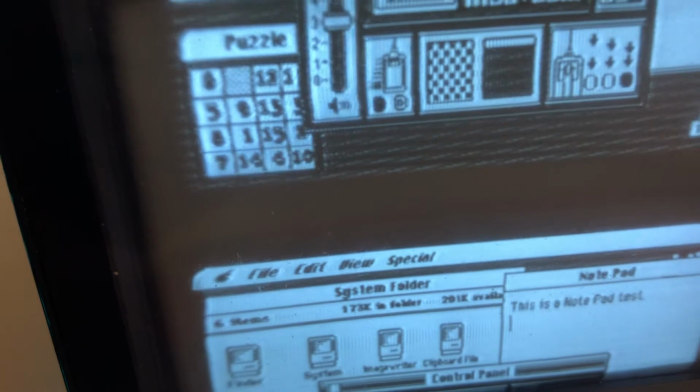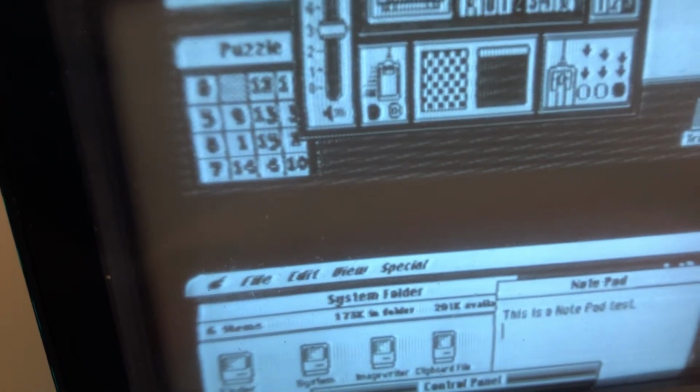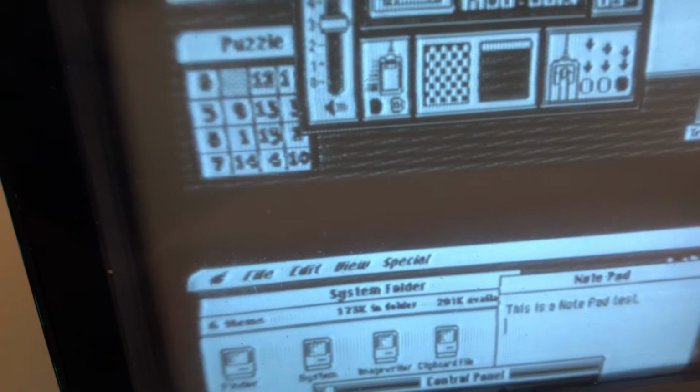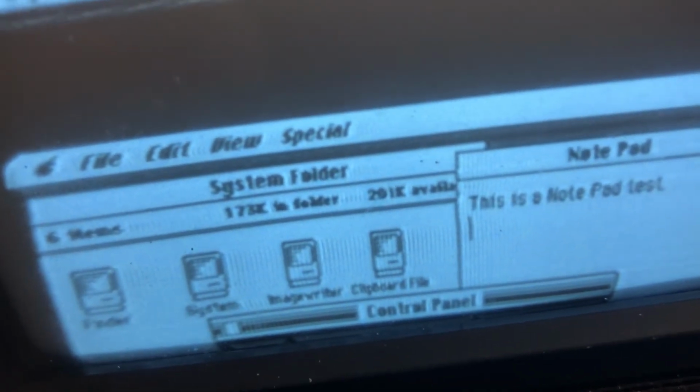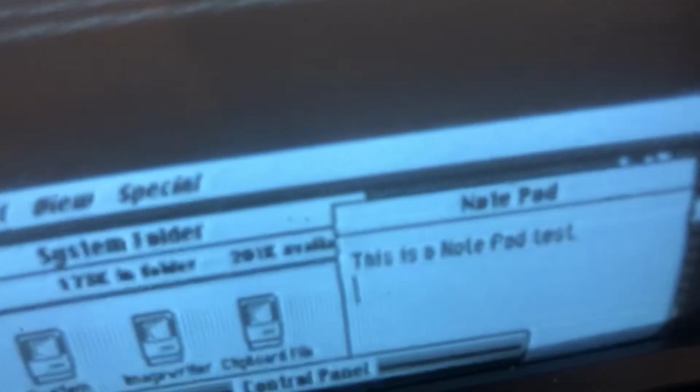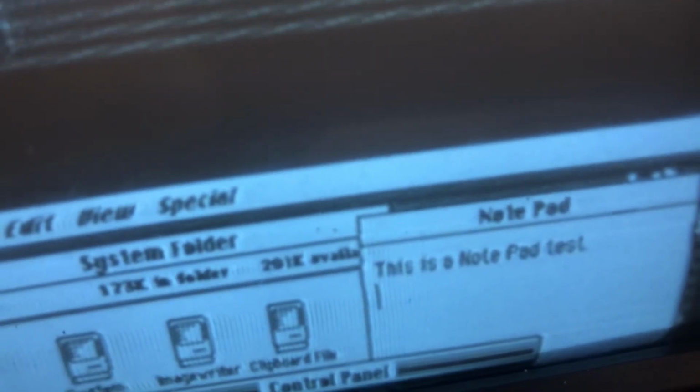Presumably fixing some of the capacitors should help this, but it's still up in the air, and realistically, tuning the sync size and front porch, back porch might help as well. You'll notice that while anything on screen looks pretty crisp overall, there's also some bleed over. You can see this very distinctly right here, when you have one line ending into another. That propagates even further when we look at the moire pattern for the background, which is supposed to be a standard checkerboard.